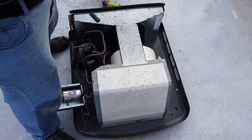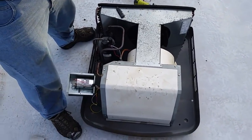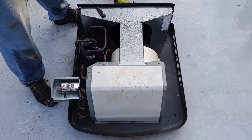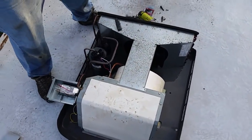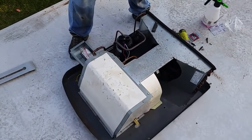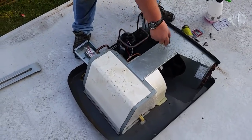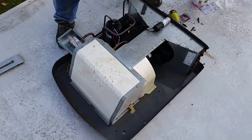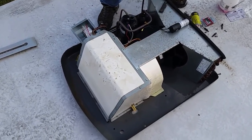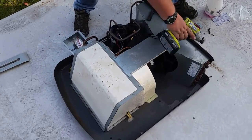Once it's running, it'll kick out of the circuit and go back to what they designed for as ideal capacitance. These help with compressor life and startup amperage. I like them — I have one on my house unit. It's not this kind, though. I don't necessarily like this kind, but this is all that fits. Most of your large house air conditioners are going to be 220. These are all 110 on an RV and they don't make many hard starts for 110. So this is the style we're using.